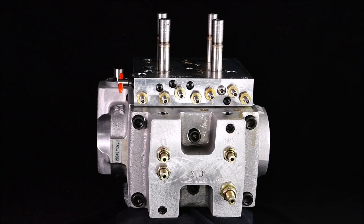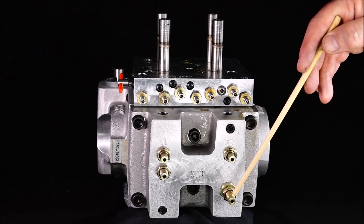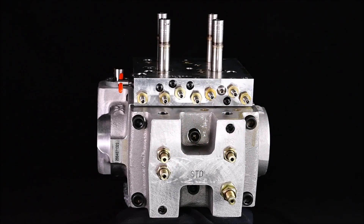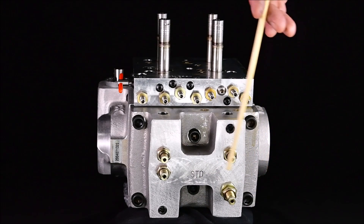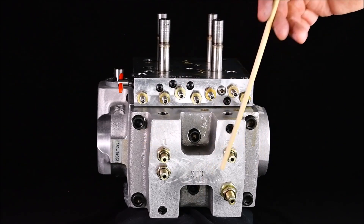These adjustments down below all deal with flow or critical measures — for example your pressure relief. These will not necessarily be that close. Pressure relief is generally set somewhere between 350 and 500 psi. These other adjusters are all hollow and are generally turned fairly far in so they don't get broken in shipping. We do provide a shield for this in shipping, usually in the form of some pink foam material. When you return your valve to us, please put the pink foam back over the front of the valve to protect these four lower adjusters.